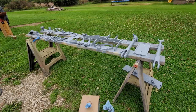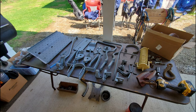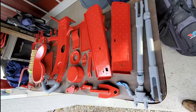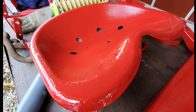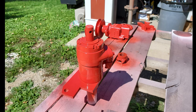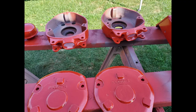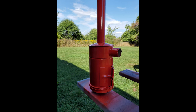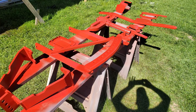After that I had a solid straight week or two of priming and painting what I refer to as the small parts gauntlet — nearly a hundred components hauled out and processed in batches, set aside for drying and eventually for assembly. These spray-outs were seemingly endless, but it does pay dividends in the end. I find that this technique provides a much better finish quality than attempting to shoot the whole machine in one go. Overspray, runs, and dry spots are never a problem.